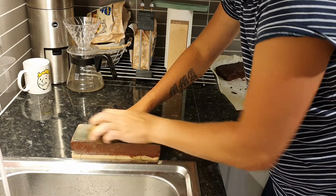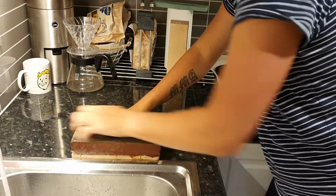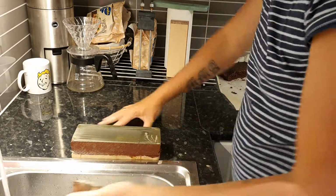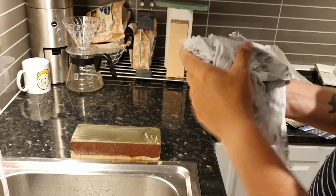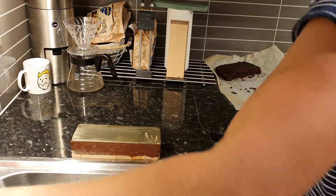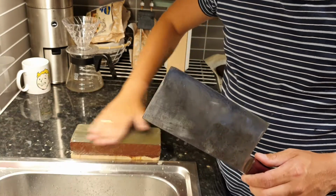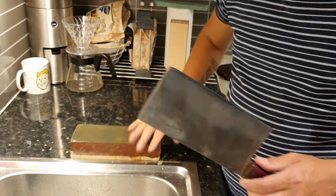It really is like a suction cup. It's actually pretty hard. Getting some speed really helps. And just making it fine patterned. There. It's not the slurry I'm after, it's more, how do I say, refining the surface of the stone. Just gonna feel that I don't have any large particles, and there was one, so I'm just washing it, so I'm sure I don't contaminate the edge. Completely glassy smooth.